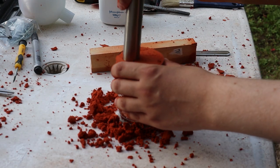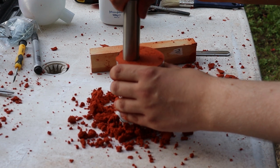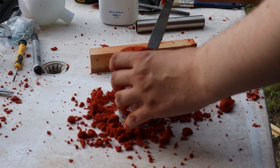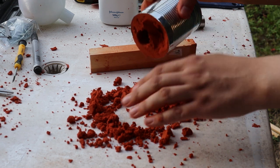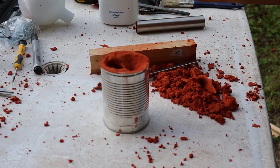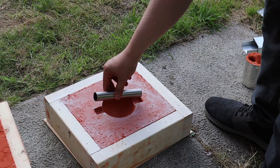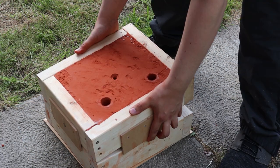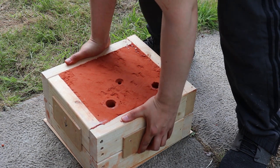Notice that the hole is not cut in the center, instead it is offset, and I have carved a small pit into the area next to the hole. This was again an idea copied from Paul of Paul's Garage. The metal was poured directly into the small pit where any bubbles should rise to the surface, and then the metal overspills and falls down the hole towards the part. This reduces the distance the metal has to fall from when it leaves the crucible, reducing turbulence, and also helps bring some of the trapped bubbles to the surface before the metal enters the mould.